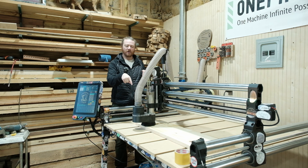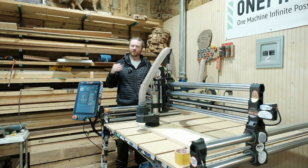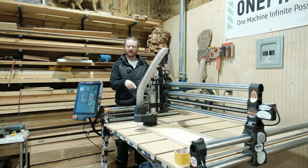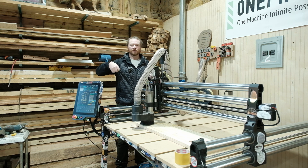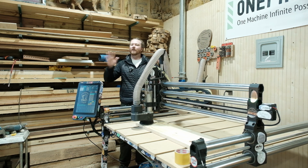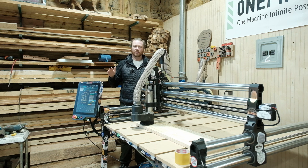The issue right now, if you haven't noticed, is the CNC machine is moving very, very slowly. Not only are the feeds and speeds a little reserved because that's how we have them on cncwithme.com, but also what you're about to see is every time it moves to where it needs to start a new cut, it's retracting very, very high. After seeing that, I know that Mitts in his file has his Z safe height a lot higher than what I normally do.